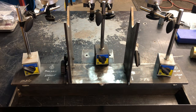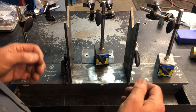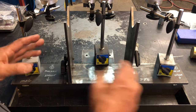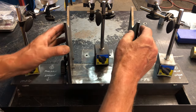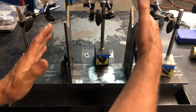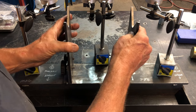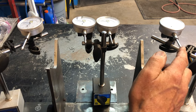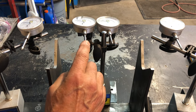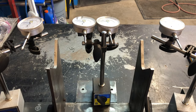In order to get correct and consistent readings on the run out, concentricity, and straightness of this crankshaft, I need a fixture to put it on. This is the fixture — it's extremely solid, all steel, it doesn't move at all. If there's any movement in it, I'll never know where I'm at. I need a super strong, super rigid fixture to do this.